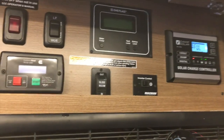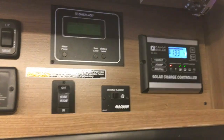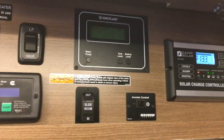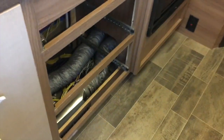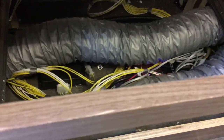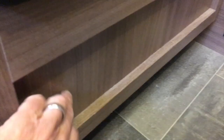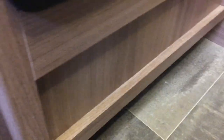Because of the way that Winnebago configured this instrument panel, there's not enough room for my battery management system up here. So I took out all the drawers and you can see I have access to the wiring here, which is going to let me run the wire from the battery compartment. I'm going to follow this duct and mount the battery management system down in this panel here.